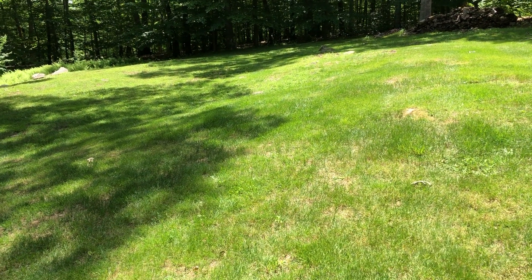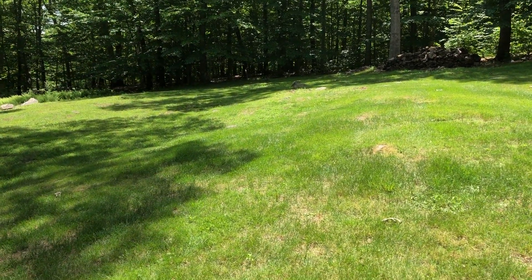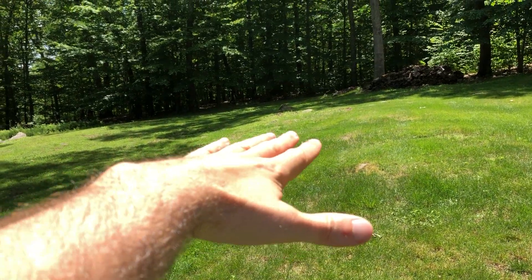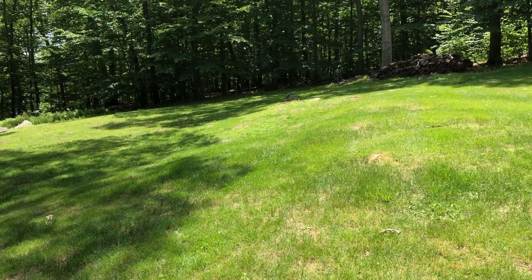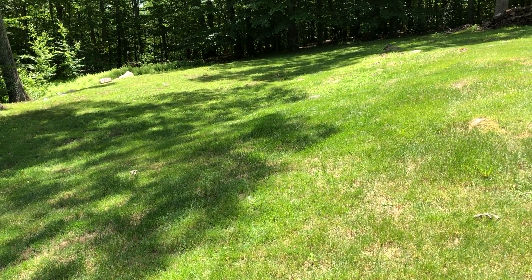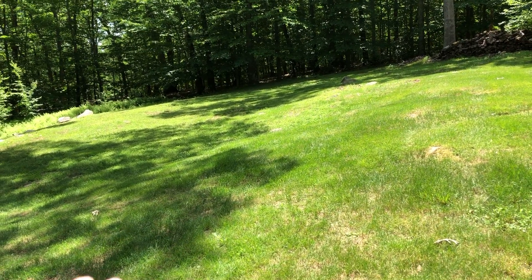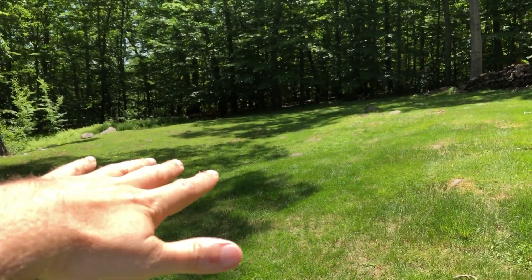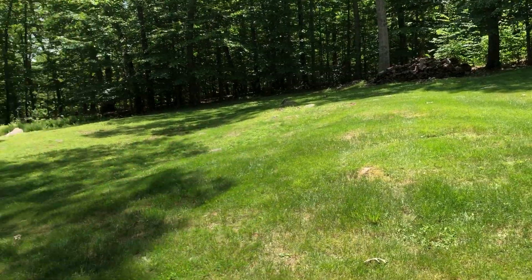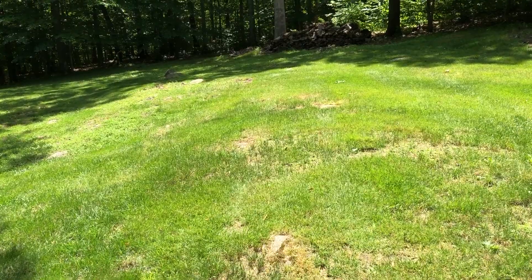The hole to fill would be roughly 20 feet by 20 feet in that area — it wouldn't fill the whole backyard, just that 20 by 20 foot area, which I think is the biggest issue you have for grading. You could get by with somewhere between 20 to 28 yards of topsoil, concentrated in the areas to skim coat on top of your fill and to fill in the holes created from excavating the rocks.